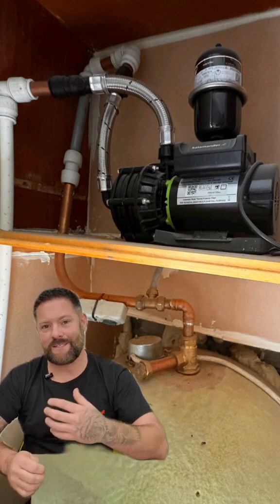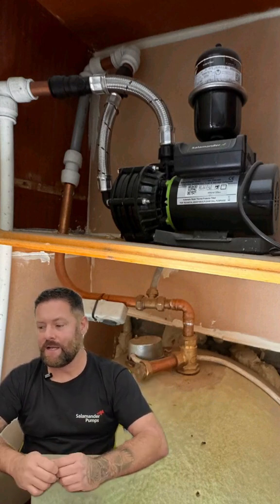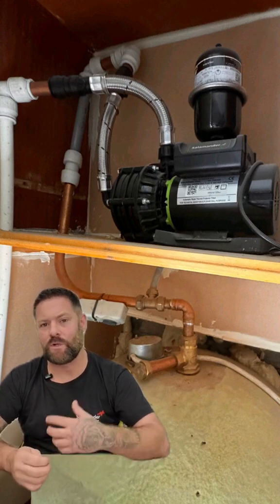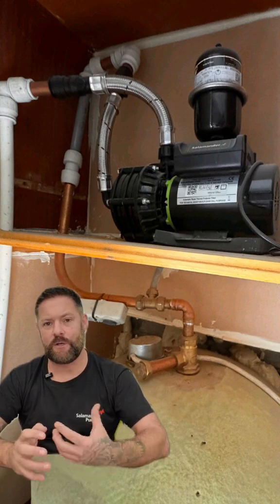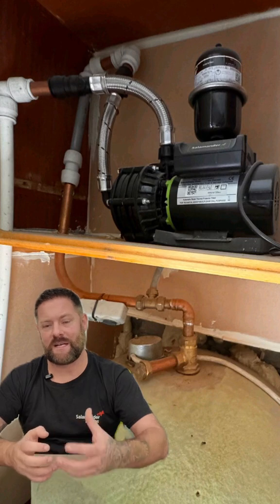What's happening here is they're taking the air that would normally be vented off for safety, feeding that aerated water directly into the pump. It's a centrifugal pump, so once air is in the pump, you're going to get a noise as the aeration starts to affect the operation of the pump and it starts to cavitate.